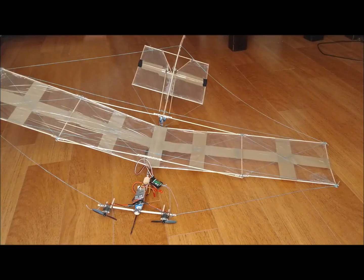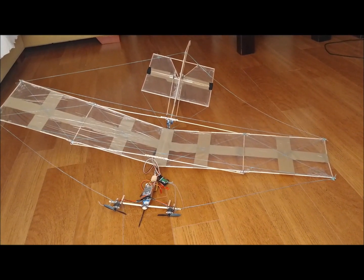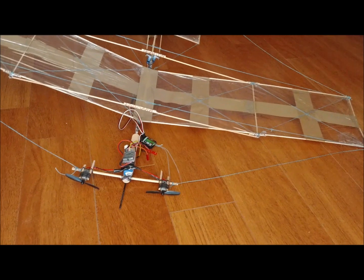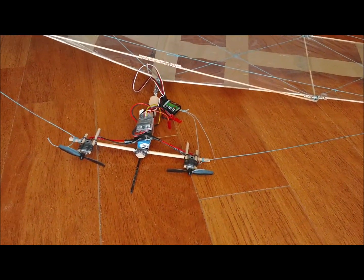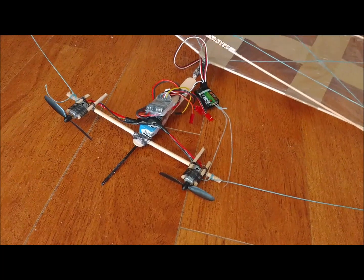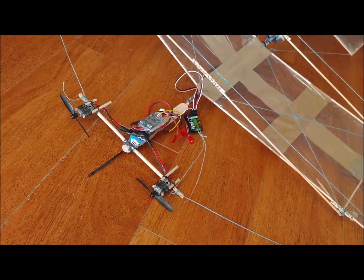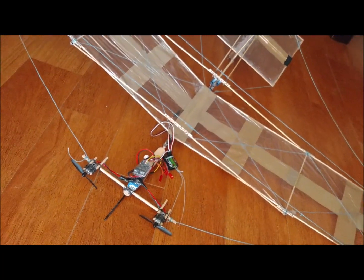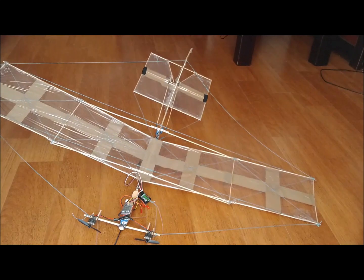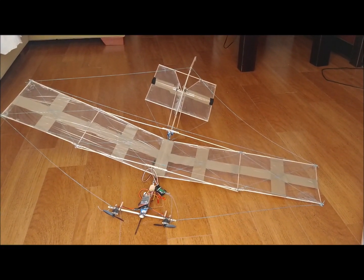The rudders are oversized because the aircraft is designed to fly at very low speeds. In addition, the distance of the tail from the main wing is small — the length from the trailing edge of the wing to the leading edge of the stabilizer is 22 cm, which is equivalent to 1.1 times the wing chord. Due to the weakness of the longitudinal fuselage elements, it is not advisable to separate the tail from the wings too much, in order to avoid longitudinal buckling.